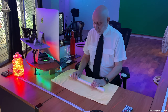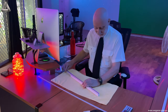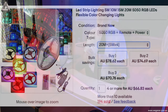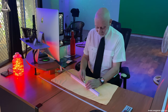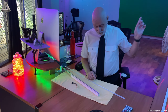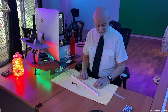I also bought aluminium channel to put the LED strip in, and glued the aluminium channel onto the timber — that worked really well. This is one of the ends of the five-meter strips; both ends are the same so I cut that last little bit off and they fit exactly into the channel, like made for it. I also have the lid which acts as a diffuser. I started in the corner where the kitchenette is, cutting one piece in half so the joints overlap.